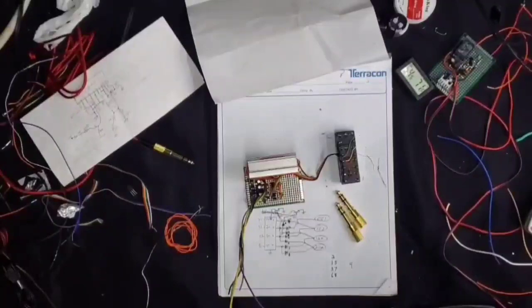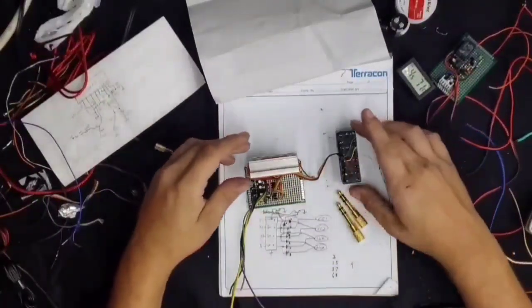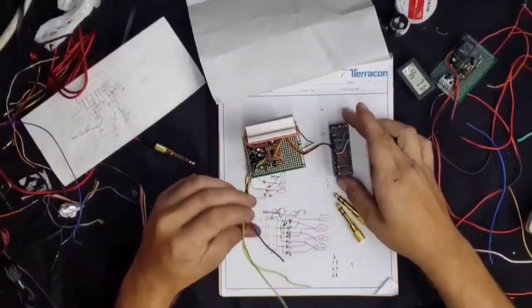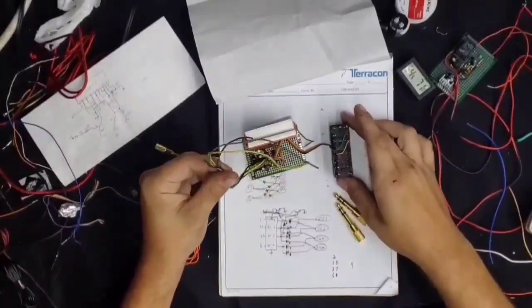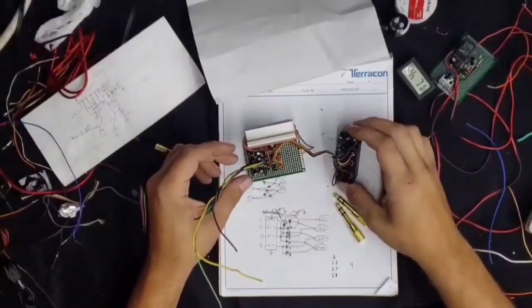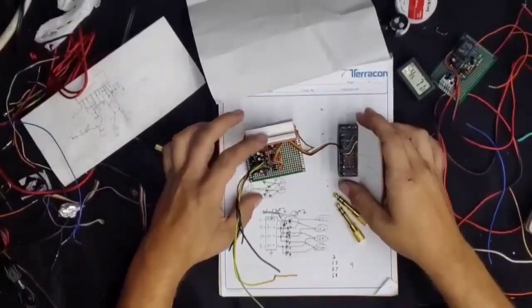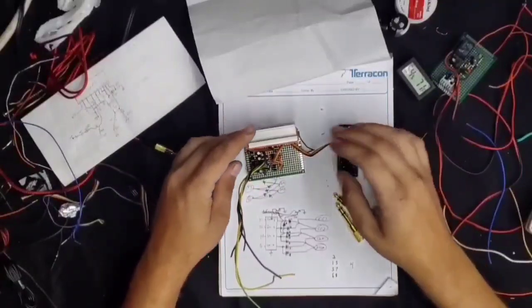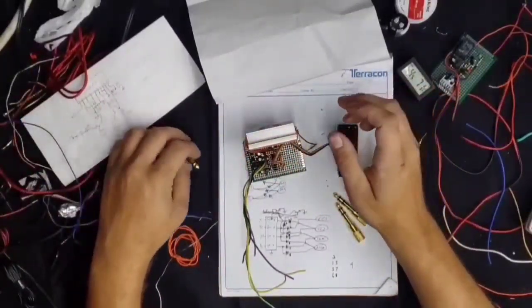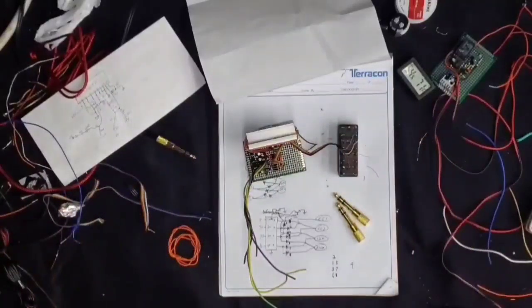I just recorded a lot of stuff with the mic turned off. What I've just done was put together this board. It takes the 24-volt AC signals from three regular old air-conditioned thermostats and turns on these four relays. And it also prevents feedback on the fan motor by having this diode attached to this big-ass heatsink. It's nearly ready. It's at that point where I need to test it.